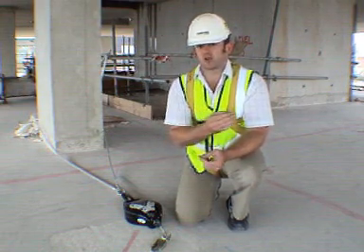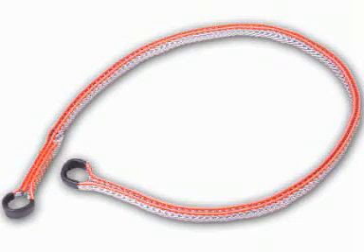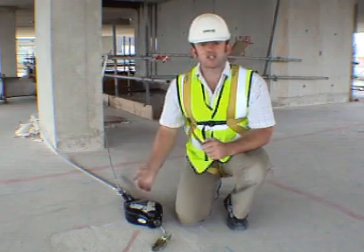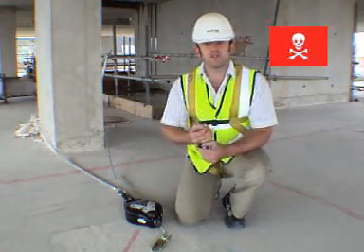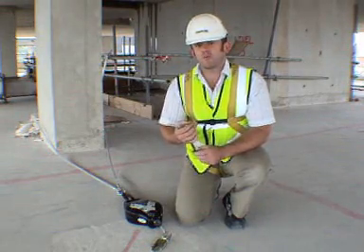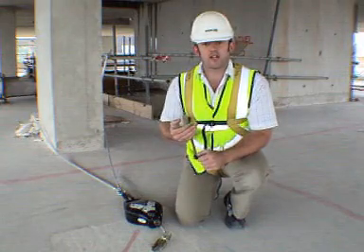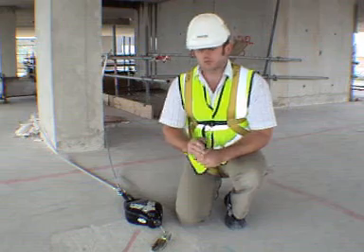Let's look at attaching to the blocks and what testing has proven. I know you guys out there haven't got dyneema tails, and attaching an inertia wheel straight to the dorsal plate with the deviating of the harness is a nightmare. So what you're doing is attaching shock absorbing lanyards and then attaching the inertia wheel to those lanyards. This is so dangerous. Number one, you haven't got the floor height — if you fell, you've got nothing to stop your fall and you will hit the deck. Number two, if your shock absorbing lanyard starts to deploy, the tearing process that slows you down produces what we call resonance. Resonance is a vibration — it travels up the harness into the inertia wheel and it turns the brakes off. So you should never use a shock absorbing lanyard to attach to an inertia wheel.